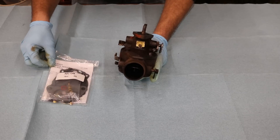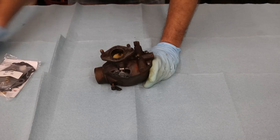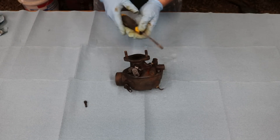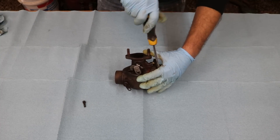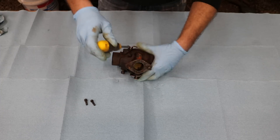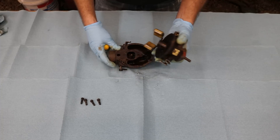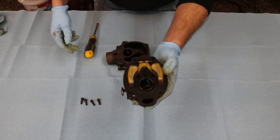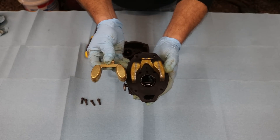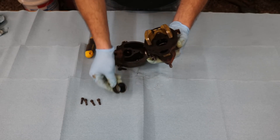That means I'll probably have to wait for parts again, but in the meantime I'm going to go ahead and tear this down. I'm sure once I get it opened up I'll know for sure whether it is a different carburetor or not. I've laid paper towels down on my bench because it's a woodworking bench with holes in it - hoping not to lose any parts. Right there is the telltale sign: you can see the float in here, and here's the float I bought for the Zenith style carburetor - you can tell they're completely different.